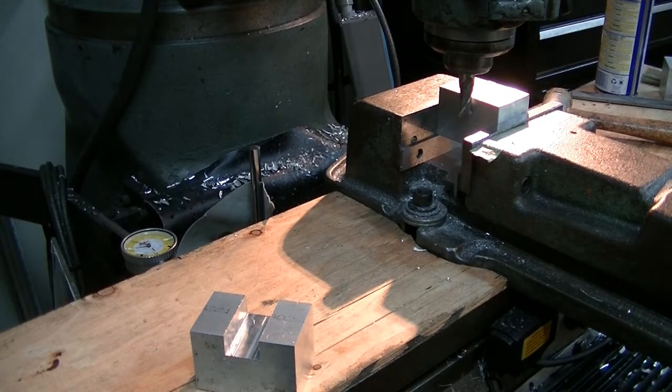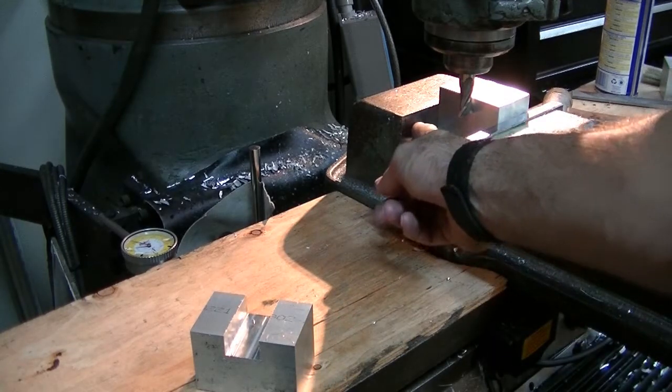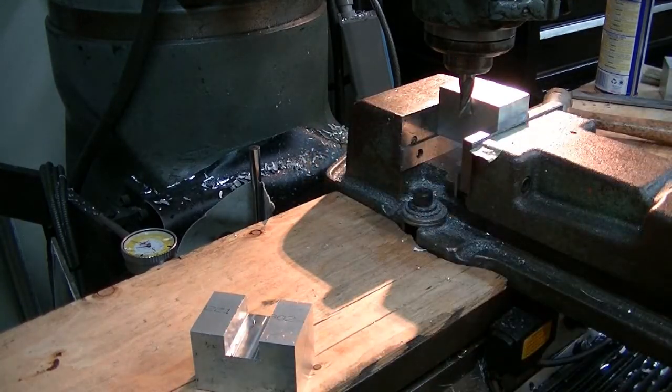What we'll do is use my dial indicator to move accordingly to get the one inch depth of cut and width of cut. The fixed jaw there hasn't moved - it's fixed. I locked my x-axis for my cut. Let's make a cut.